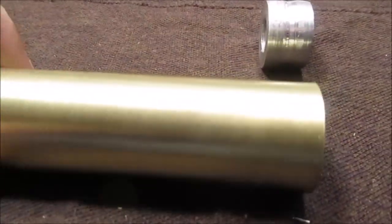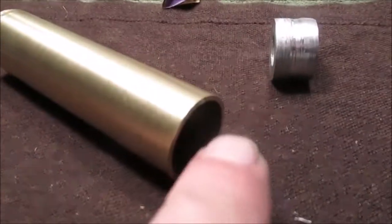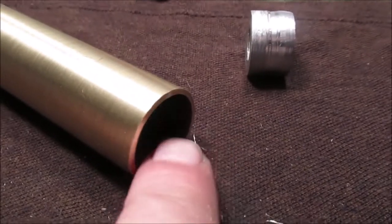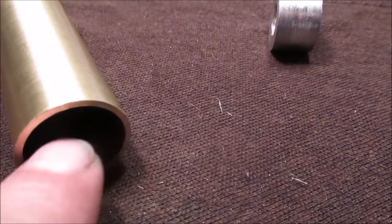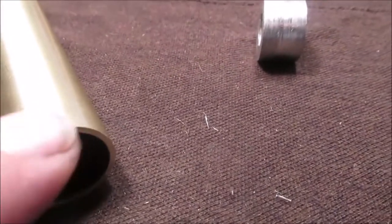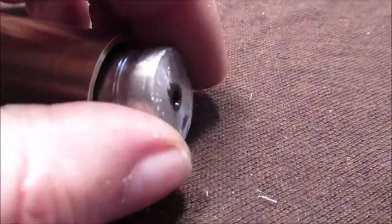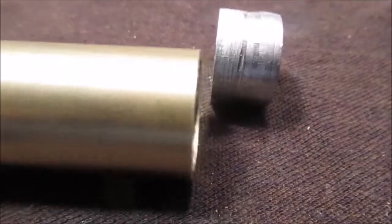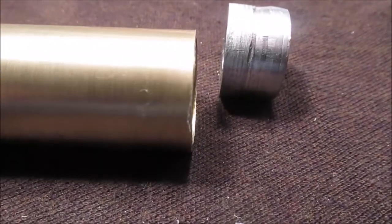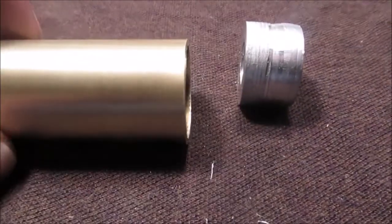We already tried making a whistle. We gave up. We made it like the ones that have a notch. You put that piece there, so you had a round slug in there, like when you make the wooden whistles, if you ever watch them made. And then you had the little piece with the slot cut off it. Well, you could blow through it and it would work, but I wanted to put compressed air, so I had it made to where I could put a fitting in the end and blow the air, and it won't work. Because it's not the pressure of the air, it's the volume of the air. So your lungs could actually make the whistle work better than an air compressor, even with that low amount of air. It's kind of hard to explain, but.